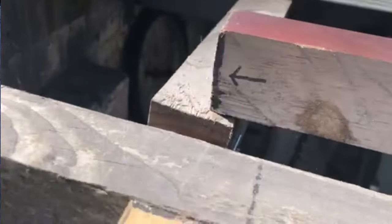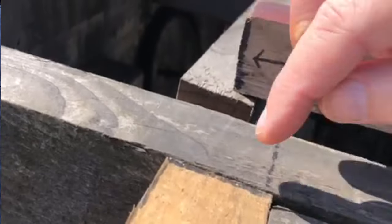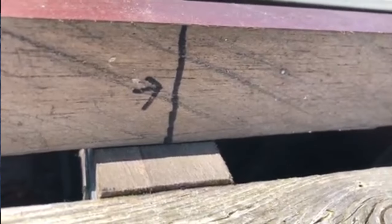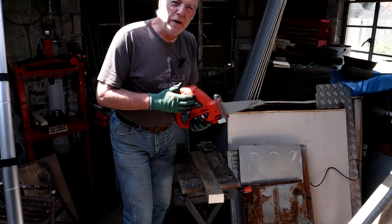So as you can see from up here, I've got this bit here - I know it's sitting on that joist but ignore that one. This bit's actually lined up pretty much with the middle of the noggin that I put in last night. So that's right in the middle of there. If I follow that along to this line here, you can see that's sitting pretty much in the middle of that noggin there. So what I need to do then is make a noggin that will go from here across to there, that lines up perfectly with that.